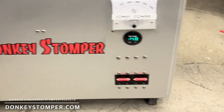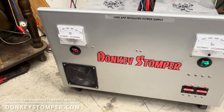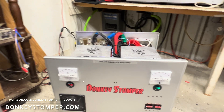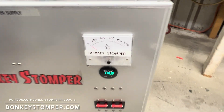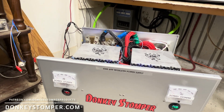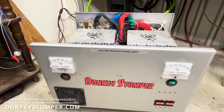We've got 40 green lights — 20 over here, 20 over here — no sirens or fans going crazy or anything like that, and all the meters are working. These cheap little meters show 14.8 to 15.0 — I think it's more like 14.8 or 14.9 but they just let you know it's all working. I've got my thousand amp meters with all the gauges set to times two, and they're actually 1500 amp shunts. I don't really care if they peg — I doubt they will because my old supplies never went much over three or four hundred amps.